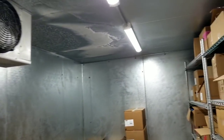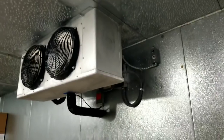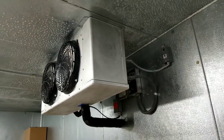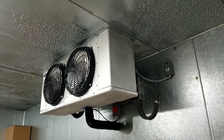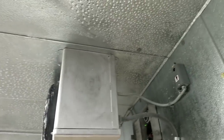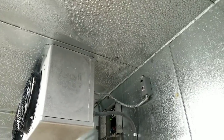We are back on location at this walk-in freezer that we had an issue with. Frost buildup is still the same issue — this is my third visit. The initial visit was the video I released two or three weeks ago. On my second visit I replaced the defrost termination fan delay switch — not because I found a problem with it, but because the manufacturer wanted me to. This is a warranty deal, so I am basically just the hands and eyes of the manufacturer.